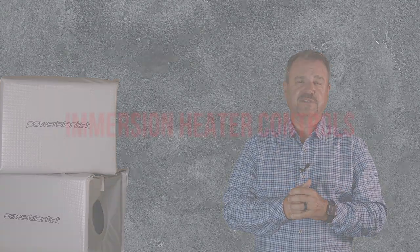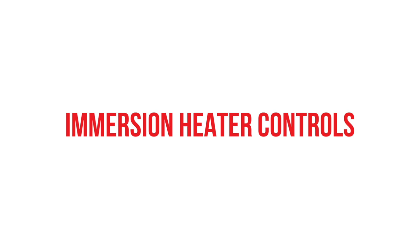Screw plug heaters are very reliable, very rugged. They can be controlled with a local thermostat and they perform very well in a lot of rugged applications. Immersion heaters are a very specific type of electric process heater. Most of the time, immersion heaters are put into a tank to keep a level of liquid at a certain temperature. Whether it's a flanged immersion heater, a pipe insert immersion heater, an over-the-side heater, or a screw plug heater, your tank heaters need to be keeping that tank at a certain temperature.